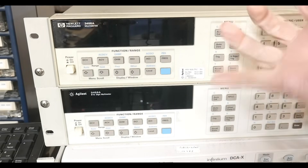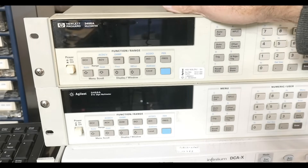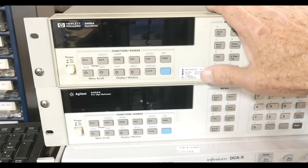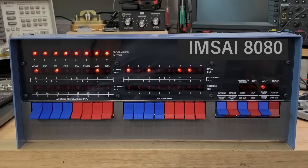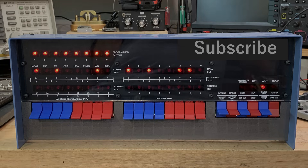Anyway, that's a great introduction to the new instrument. Comment down below — if you had an 8.5 digit voltmeter, what would you like to see done with it? What experiments would you do? I have one idea in mind: metal-to-metal thermocouples — just how much voltage does a solder joint cause? And maybe some thermal fluctuations in certain things. I definitely want to do a bunch of stuff on batteries — they're interesting because batteries are a very, very slow change. Pretty cool instrument.